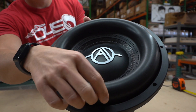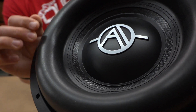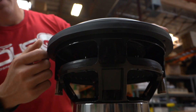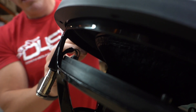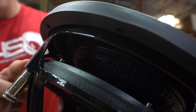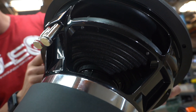Starting off on the front side we have this nice mega roll surround — it's going to be able to get down on the lows like all the bass heads love. You can see right here we have a double stitched surround to the cone, and a nice embossed Ampere Audio logo on the dust cap. Coming around to the side you have your standard mounting gasket. We're using the TI style basket, so a wide open basket design, with super thick tinsel leads and a spider hold down ring that's glued and screwed down — that's not going to come apart.